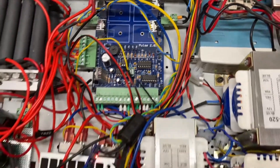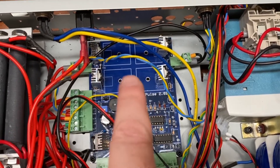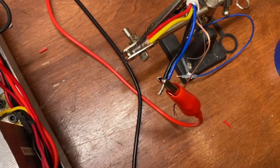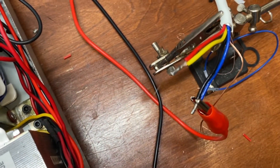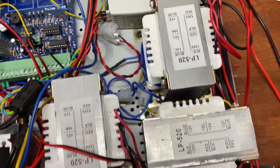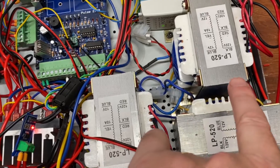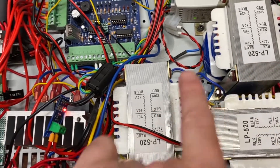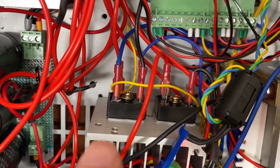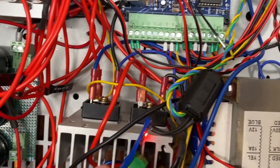These are the four MOSFETs that will switch on and off the actual outputs that will go eventually to the wire cutter or the EDM plunger. I have three transformers, 25 volts each AC, that are connected together and going through these two voltage regulators to be turned into approximately 106 volts.